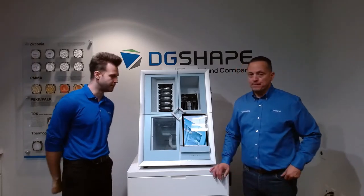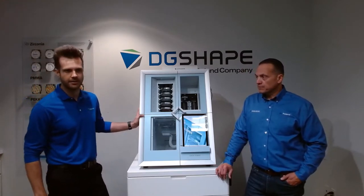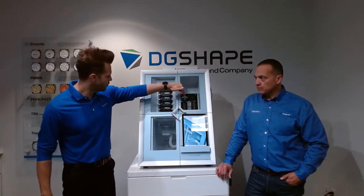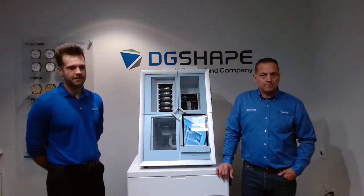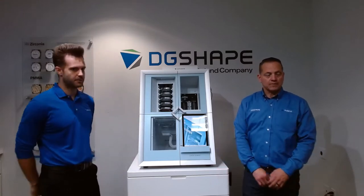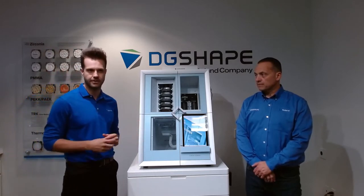Sure thing. The DWX-53DC's new smart dust evacuation system and isolated milling chamber keep debris isolated from important components, such as your tools, your rack up here, and even the spindle down below. The new solid body design results in less rocking and vibration when the spindle is applying high RPMs and torque to PMMA and resins. This will result in predictable, positive outcomes.